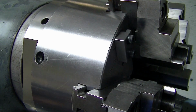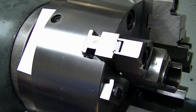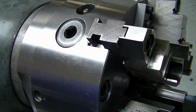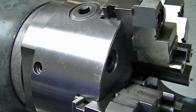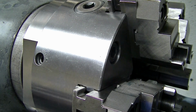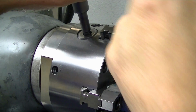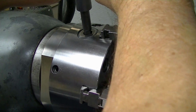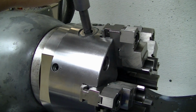And that's all you do, just put that on. As far as the system goes for the taper nose, just put it on. You never want to put the lock in and smack that chuck in place with the full inertia of that chuck. You just want to put it in and give it a gentle turn like that. That's all it needs. You put it on much tighter than that and you're gonna have trouble.